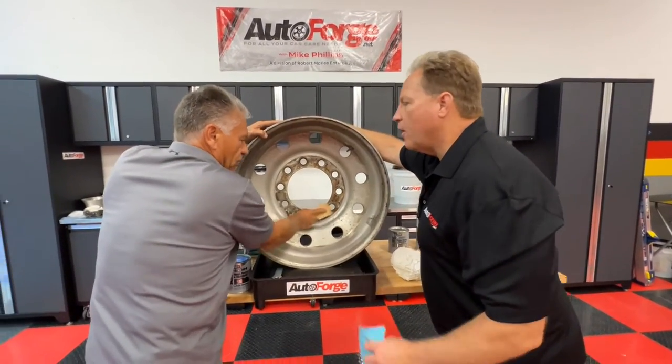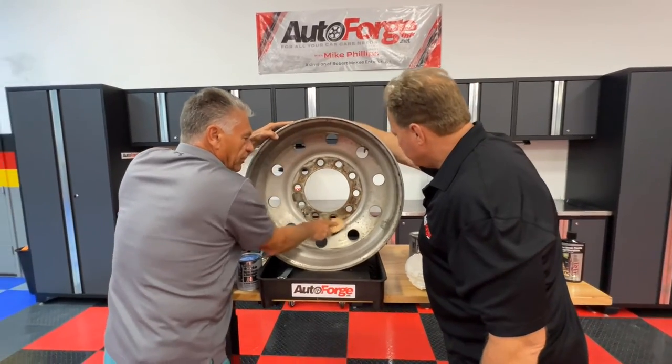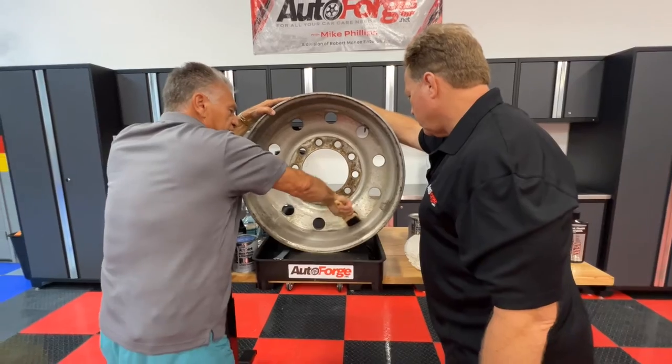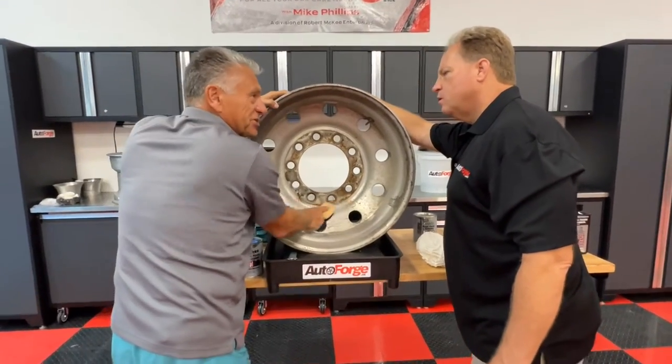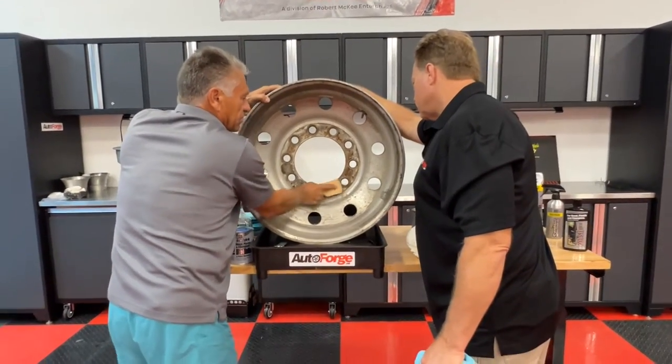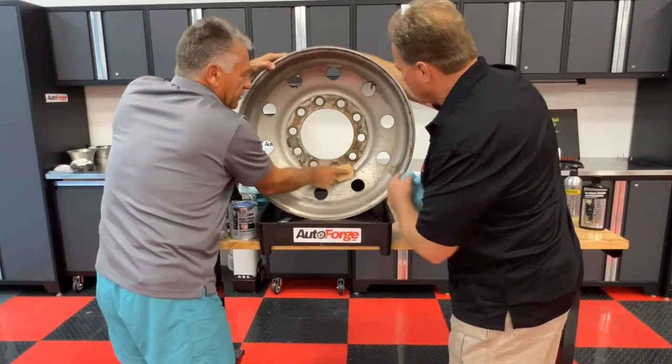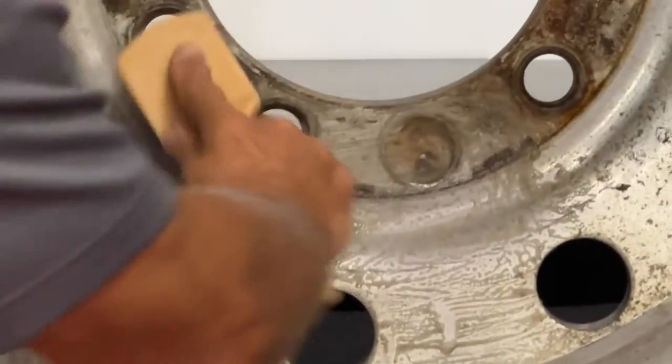That's correct — nothing to fear. The biggest thing is, what you'll see right away, we're going to rinse it. That's the one thing you have to do, and that's true with any chemical like this. If you don't rinse it, it's going to keep eating at the metal. And you can see even the rust — look at this where it's really, really nasty here — how that pre-clean is taking that off. So the rinse with water, that'll neutralize it? Correct. It's going to instantly make it stop.